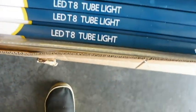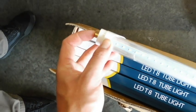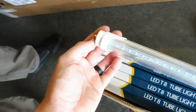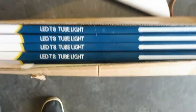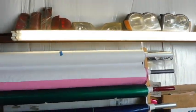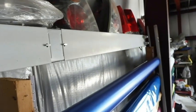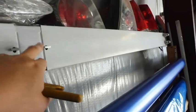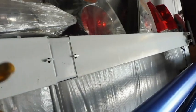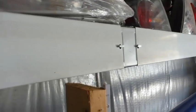Let's check out the bulbs. Here we've got the T8s — these are the ones with the single end, the one pin. Got these on Amazon. So I'm going to start on these here since they're easiest to get to. We killed the power over here. We need to pull the bulbs out, then twist the pins so the covers come off and we'll get to the ballast. I'm going to have to delete the ballast on these and I'm going to show you how to rewire them.